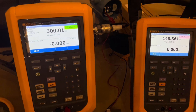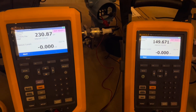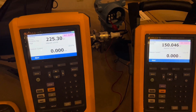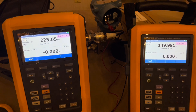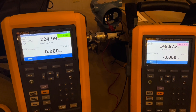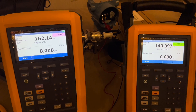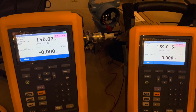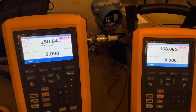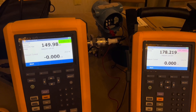The value I missed is the speed of the 729 Pro. As we look at this, you'll see the 729 Pro has already made steps up, already got to 300, and is on its way back down — while the 729 is still trying to stabilize at 150 PSI. Because of its additional capability it has basically a backup cylinder that pre-charges, helping it reach pressure much quicker. Even if you only need lower pressures, I believe the 729 Pro is worth buying just for the sheer speed of it.